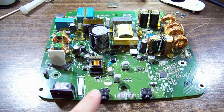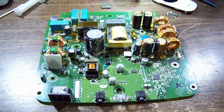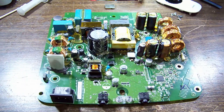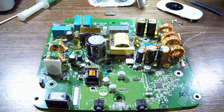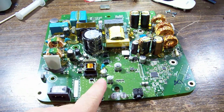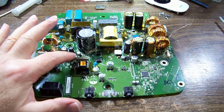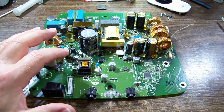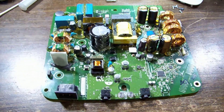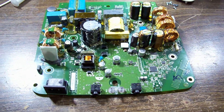This is our mains input. This LED blinks to tell you what's going on — it doesn't blink at the moment, but I don't have the rest of the module to plug in, and I don't have the on button, which I'm picking would attach over here. But I now have a five volt rail, a 13 volt rail, and 1.1 and 3.2 volts over on the microprocessor, so I'm pretty sure it is fixed. I can't find anything else that appears to be damaged or any other bad components.